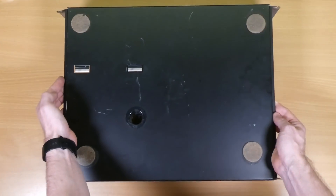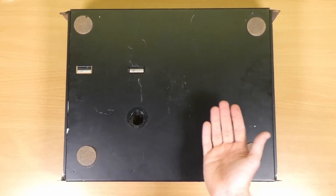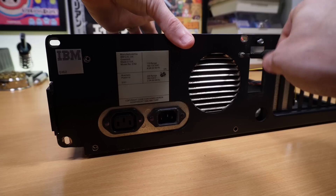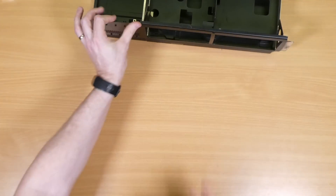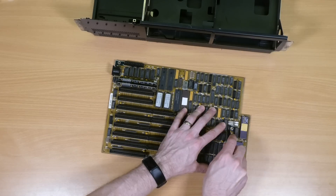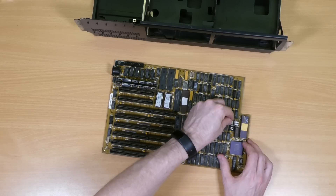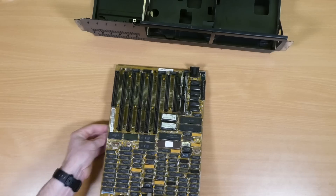So now it's time to start putting this old PC back together, and the case is in lovely clean condition with its original cork feet all intact, which is always great to see. The first thing to go in is that reconditioned PSU, which slots into a couple of tabs on the bottom of the case and also screws in from the back. A PC isn't much of a PC without its motherboard, so that goes in next, and as mentioned in the previous video, I'm going to build this up as an 8MHz system for now, so I'll swap the crystal out for the 16MHz version. If you want to know a little bit more about how this works and haven't seen the previous videos in this series, I'll link the playlist down in the description below.